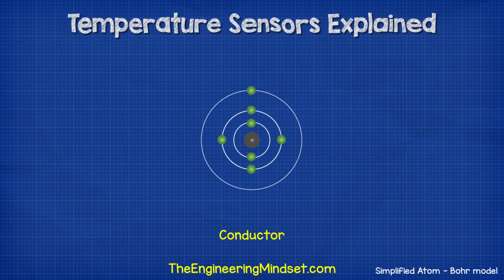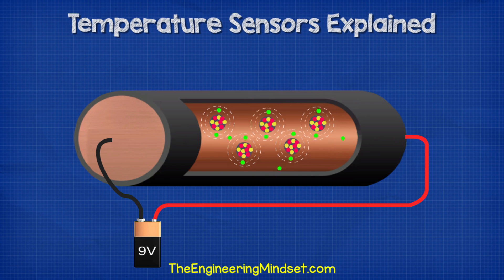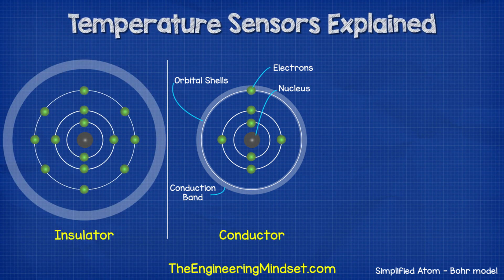If we look at a simplified atom of a metal, we have the nucleus at the center and then a number of electrons on different orbital shells. A conductor has one to three electrons in its outermost or valence shell. Each shell holds a maximum number of electrons, and an electron has to have a certain amount of energy to be accepted into each shell. The electrons farthest away from the nucleus have the most energy. We need electrons to be able to move between atoms in a material for it to carry electricity. Electrons are held in place by the nucleus, but if they can reach the conduction band they can break free and move. With a metal atom, the conduction band and the valence shell overlap, so it's very easy for an electron to become free. With an insulator, the outermost valence shell is packed — the nucleus has a tight grip on the electrons and the conduction band is far away, so electrons can't reach it and escape.